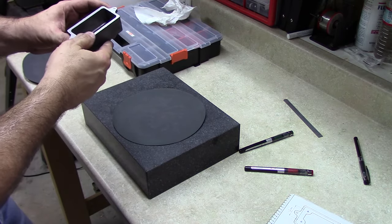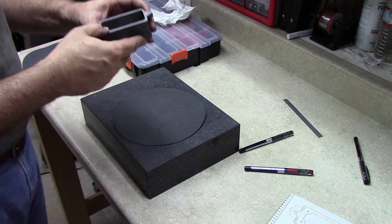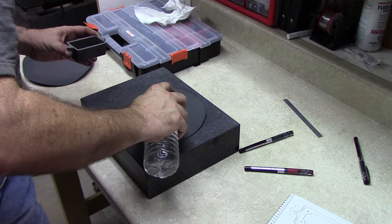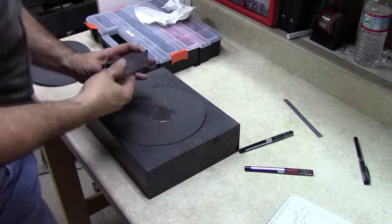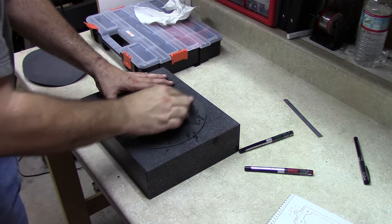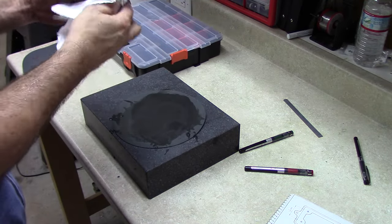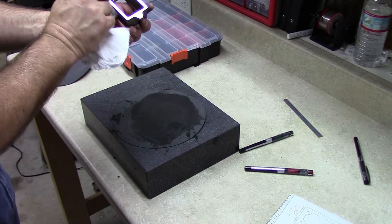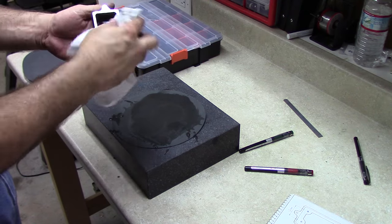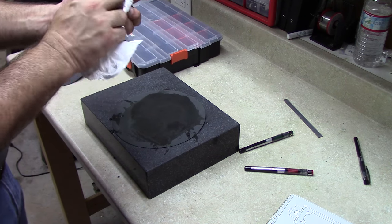As I noted at the beginning, this is my first attempt working with iron casting, so I'm kind of learning as I go. See if a little water, this is wet dry paper, helps to keep the paper clean. It's not quite as important for the bottom piece, it's already flat and any low spots aren't really going to matter, but for the top surface, it's actually going to be visible.